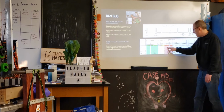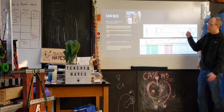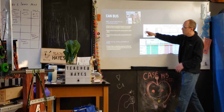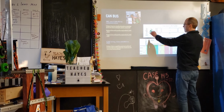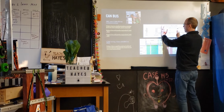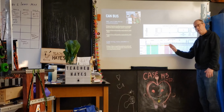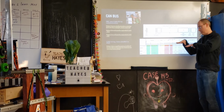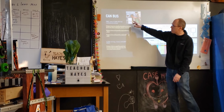And then you take all this sequence of ones and zeros, the CAN encoder that's on each of these devices would strip off this stuff. Oh, it's designated for me, I'm listening for this. It would look at this, and then it could parse that data payload. So this is how the CAN's working physically. This is the physical layer. This is voltage going on and off, and it's sending those across this.